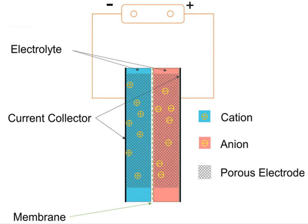CDC electrodes with tailored pore design offer as much as 75% greater specific energy than conventional activated carbons. As of 2015, a CDC supercapacitor offered a specific energy of 10.1 Wh/kg, 3,500 F capacitance and over 1 million charge-discharge cycles.